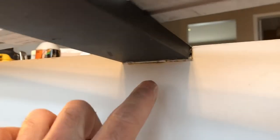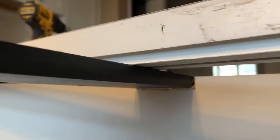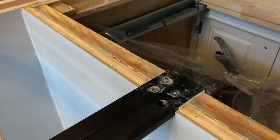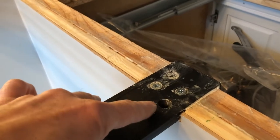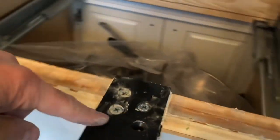Mine was just a hair down, so with only one screw in the back I was able to lift it up, get it where I wanted it, and slide a shim right under there between a bunch of liquid nails. That way it's solid. Then I screwed it in exactly where I want it. All that liquid nails gushing out is going to bond and be solid. Don't over-tighten — let the liquid nails dry and come back to hand tighten after a couple of days, because it takes two to three days to dry up in there. Then it's going to be rock solid.